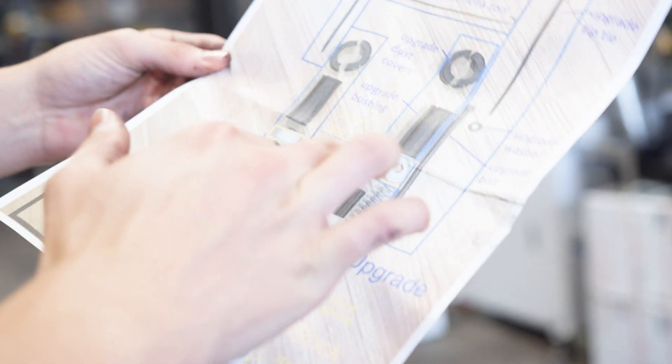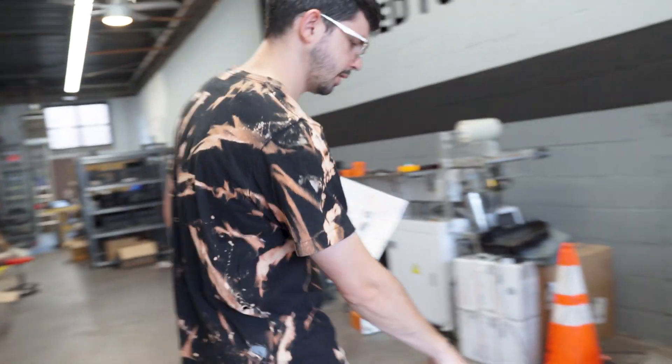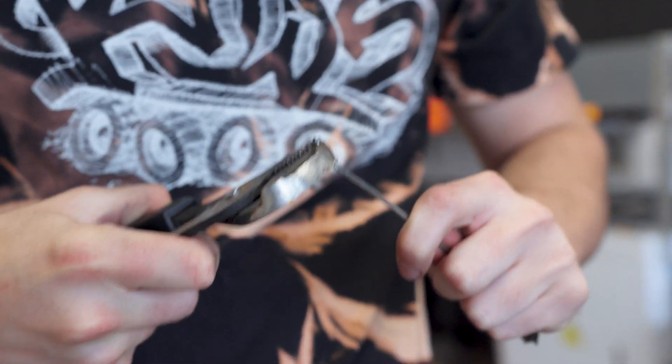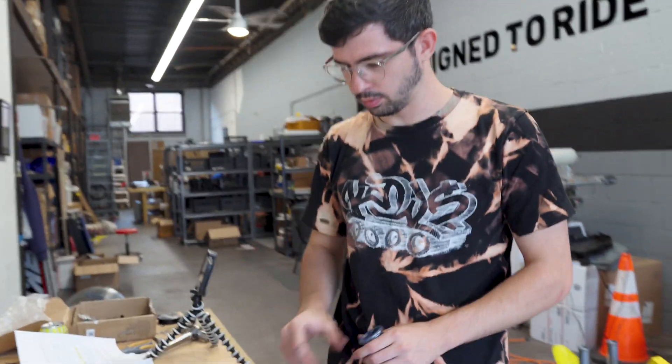Just took off the axle mount. The suspension is actually inside here. These are all upgraded components and these are the stock parts. I'm adding these springs into here to basically extend the fork. You'll have the standard spring and then there'll be this spring, which is a bit stiffer. So it'll always keep that height, but it'll still have room to dampen if you go over bumps. I'm using this metal hook to get the top of the bushing and the piece of the spring out. It was a little short, so I added a little tab on the end to hold on to. Now I'm putting in these new aftermarket bushings — they work as a spring separator. I'm just going to grease these up and drop them in.